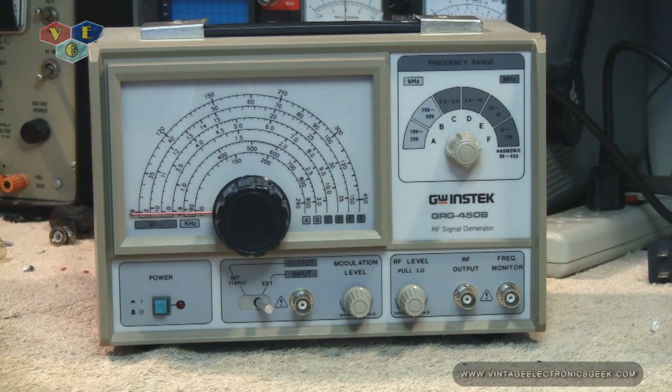I've had no real issues with it. As far as what it does well, I haven't really experienced any major drift off of it. You fire it up, let it warm up for about 15 minutes or so, and it's pretty rock stable. It's pretty stable once you fire it up, but the more you let it warm up, the better it is. As far as drifting, it's probably going to drift within a couple of kc of its center frequency. So it's really not too bad, and it's really nothing that you want to use as target practice.